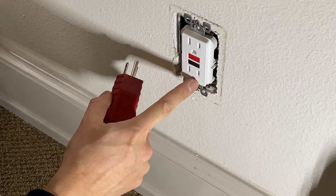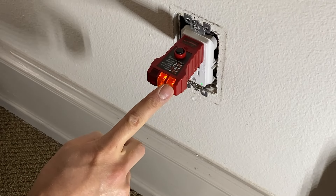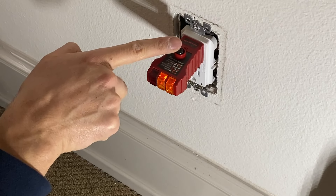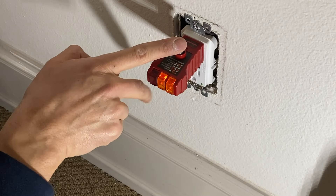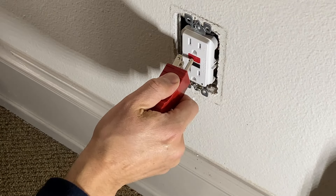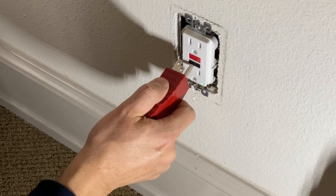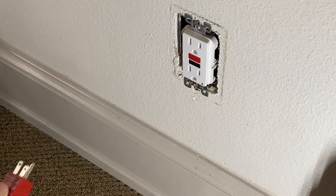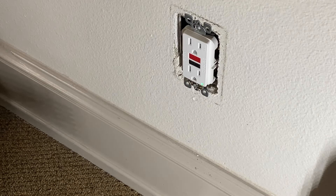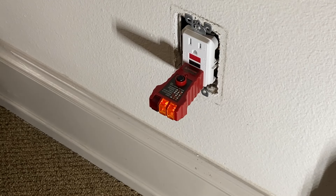When the green light comes on, that means it's on. Now we can plug in and see it's wired correctly. With these outlets, you can test it from here to see if it trips — there you go, it has tripped. Press it again, then press the test button to confirm it trips. Now we have a working GFCI outlet — that's how you install it. Pretty easy, hope it helps, thanks for watching.